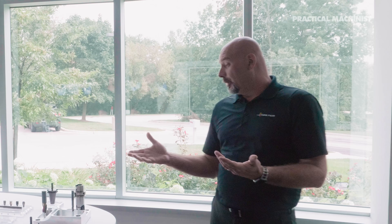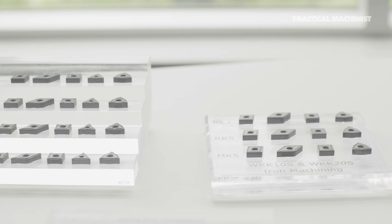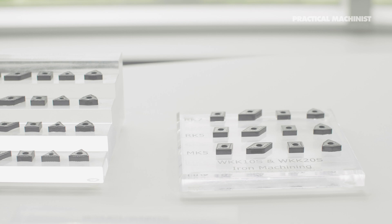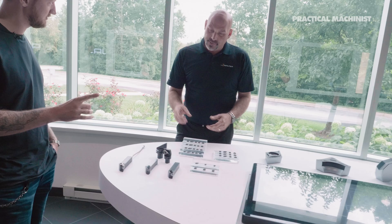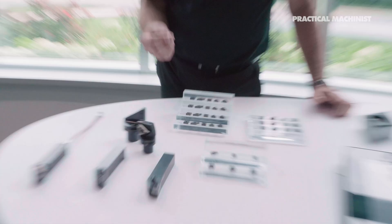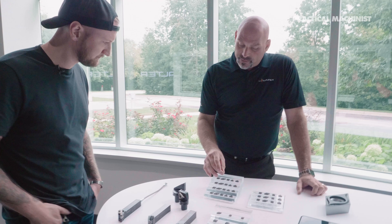I've lived and grown up in the area all my life — 28 years as a machinist. Started off making carbide tools from solid or from preformed blanks, where we would finish and hold tolerances within the millionths. Over this way, when we talk indexable ISO turning, we have a full line of that. ISO turning uses the same size and shape insert across the board — standardized across Walter and any other tool supplier out there.